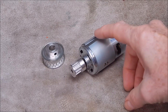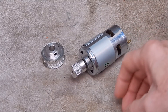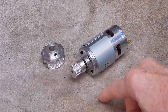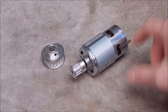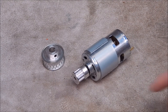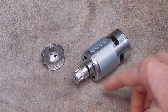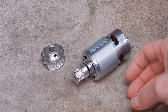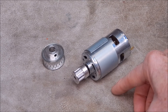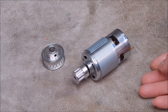Banggood also sent me this little electric motor, which is a match to the spindle assembly. It appears to have a 5mm shaft that takes the gilmer drive pulley, and it has a high-torque output. It's rated to run on 12 to 36 volts and spins at 3,500 to 9,000 RPM. With a two-to-one reduction ratio, that means you're getting a spindle speed of anywhere from 1,750 to 4,500 RPM.